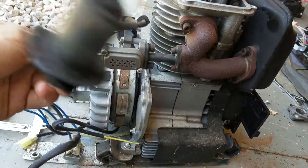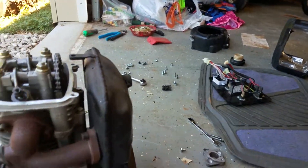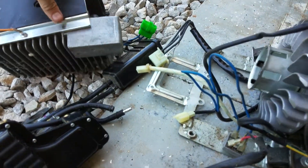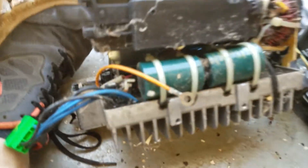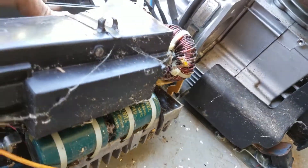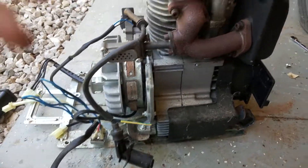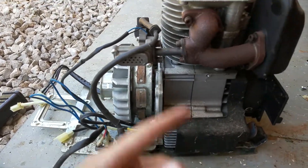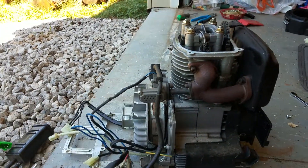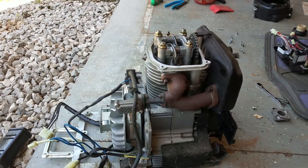I'd like to see them address some of these issues. It takes probably at least an hour just to disassemble this because it's all little parts and pieces. Just be very careful around the big capacitors down here and your electronics — those can kill you, those are 450-volt capacitors. There's not much serviceable in here, and some of this stuff when it breaks is kind of a total loss. This one is just as expensive as the other one — like 500 bucks or so. Generac, you guys need to figure out some of your issues and address them. Thanks for watching — comment, rate, subscribe, let me know what you guys think.